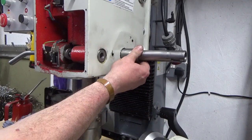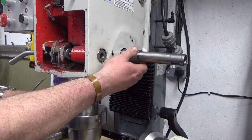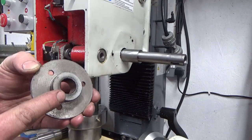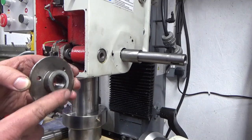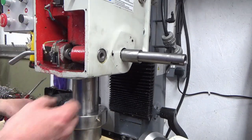As soon as I get into these bearing diameters, I can see it pushing off at the back side. I've even taken the bearing out the other side to see if that helps, and the pinion would then go through the rack. Even without this bearing in place, it still won't go through.